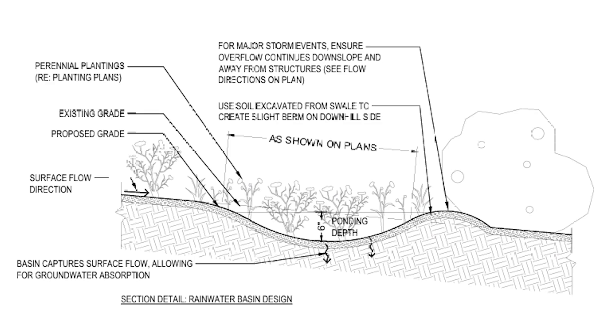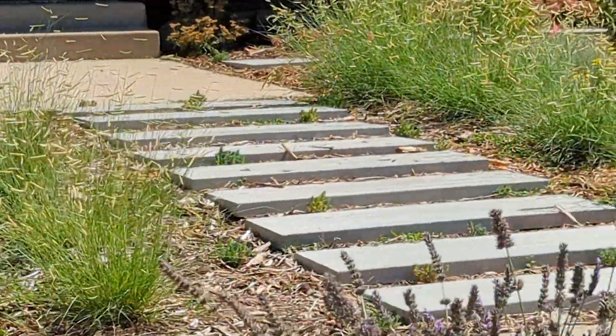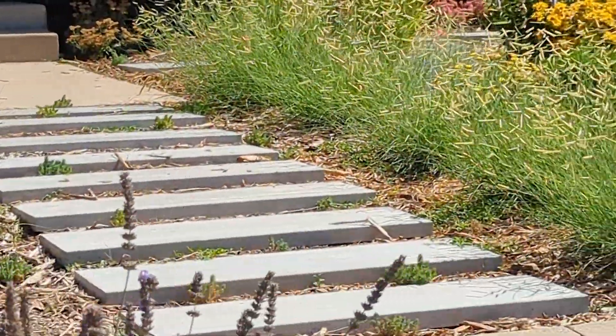Passive rainwater harvesting is just getting the water to your plants directly, using earthworks or grading to make sure that water, when it exits your downspout, doesn't just run off to the street. We're essentially digging to create speed bumps for the water so that it absorbs and percolates into the soil. When you use native drought-tolerant plants adapted to the rainfall and dry-out periods of your region, you really don't need to irrigate in the interim. The system is only watering the plants when it's raining — and with a native plant, that plant is able to absorb the water it needs and then go extremely long periods through drought and still survive.